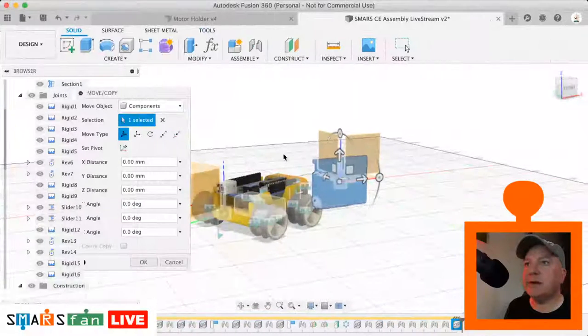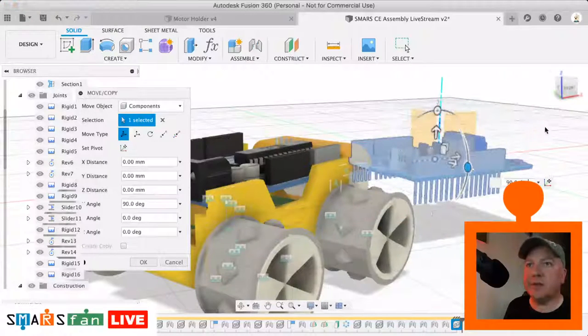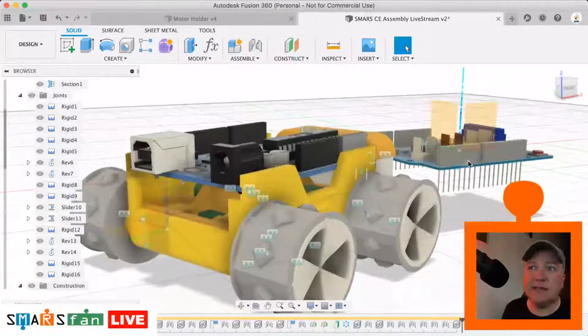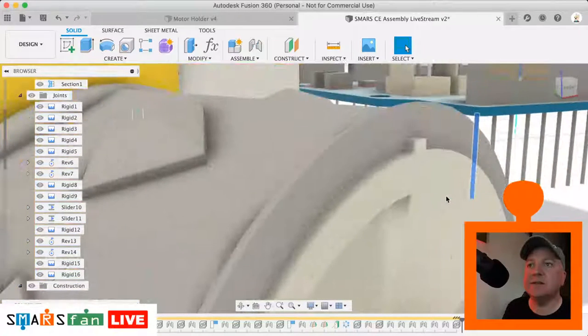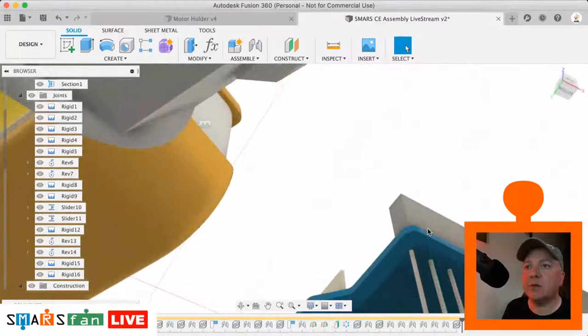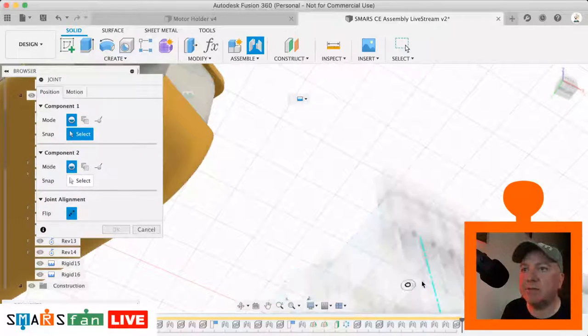Let us close our data panel and let us flip this over. I think it's just, yeah, there we go. Okay. So this is actually easier to insert because we just need to grab one of the pins there, which is going to be this pin here. We just need to get to the bottom face of that and create our first selection. There we go. So we're going to do a rigid joint, select that face which is just there,